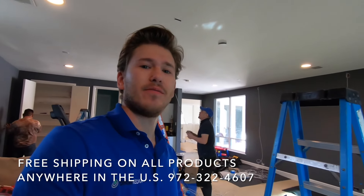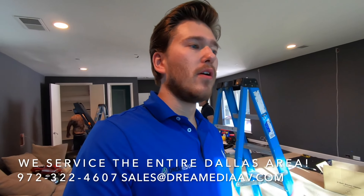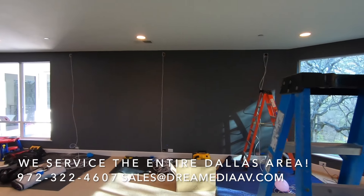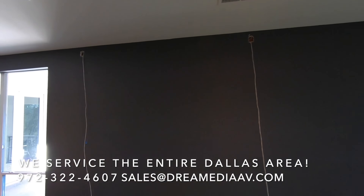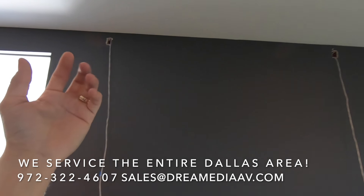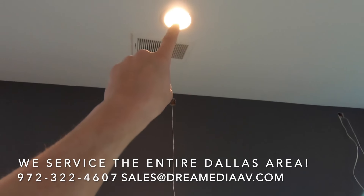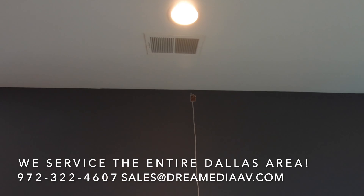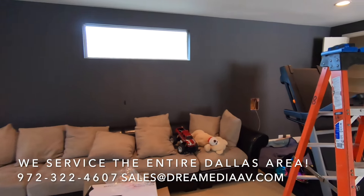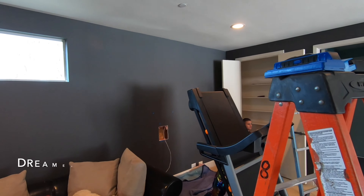Since this is a retrofit situation, I'm having to do a lot of precise measurements to make sure that everything is as close to Dolby's recommendations as possible. We have our front lines in — we had to cut at the top of the wall on all of them, there's just no attic access at all. Basically we have a guy up in the attic and a guy down here. We drill up through the framing at the top and shoot it up to the guy in the attic where he can actually stand, because there's no way you can get a drill into that tight part. It looks like we were able to get this one down with no issues — the pitch of the roof is a little steeper there, which gives you more access to get your body into the wall.